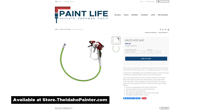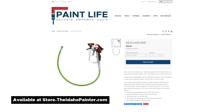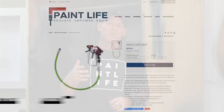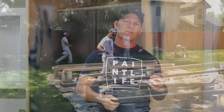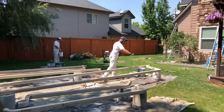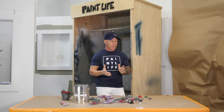If I had the opportunity to add one more fine finish tip I'd add a 510 tip. In new construction most of my work used a 510 because we were spraying a lot of doors — you get a wider fan and can move faster. But the 310 is the most versatile fine finish tip you can use: great for gutters, downspouts, front doors, side doors. Any time you want that automobile-like finish, you need a fine finish tip.